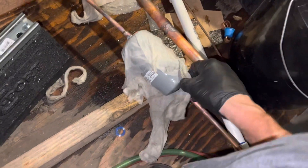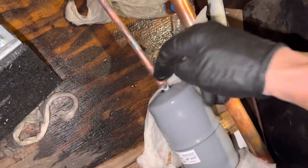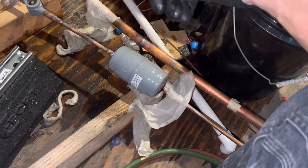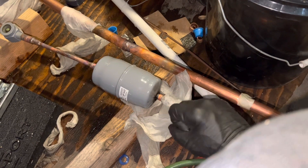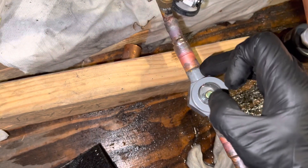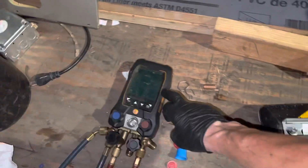As you can see, I already brazed in — notice no damage to the paint. This is not outside, so we don't have to worry about corrosion, but there's just a little ruffled area. We're not in a corrosive environment, but the ocean is close by and there's salt in the air, so you'd want to clean that up with a wire brush and spray some 98% epoxy galvanized — 98% zinc — that comes in a spray can, a heavy little can, or you have the wipe-on stuff. As you can see, there's no discoloration of the paint because it was properly wrapped and never heated up.